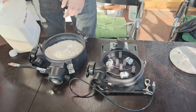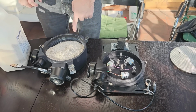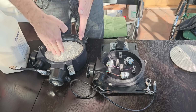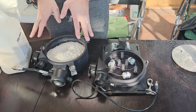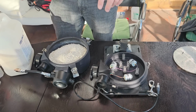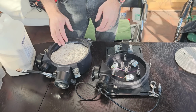And you probably saw these grooves here on the side. That's a very smart one, because if that would be flat, gas could actually travel past there, but as the lime goes in these grooves, it creates an uneven surface, and it prevents channeling basically.